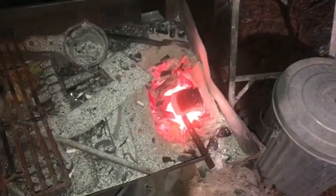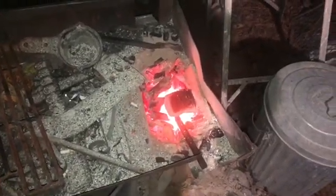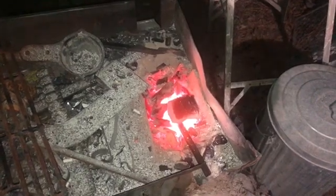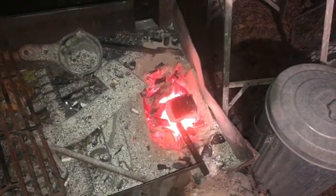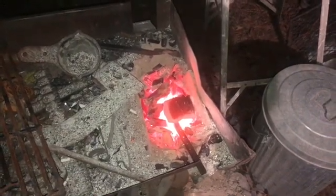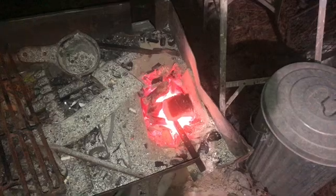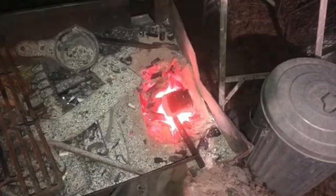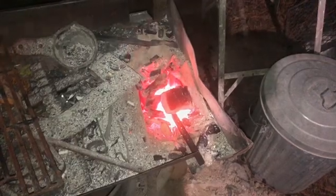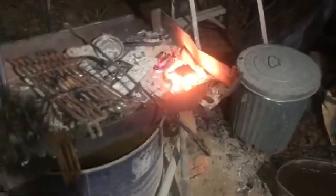And I think that everybody should learn to use every kind of coal: charcoal, bituminous coal, anthracite. Anthracite sometimes you can get at Tractor Supply, but I don't have any anthracite right now. They usually only have it in the wintertime and usually only in Mariana, but it's cheap and it does a good job. It's just hard to keep lit. Start out with charcoal.